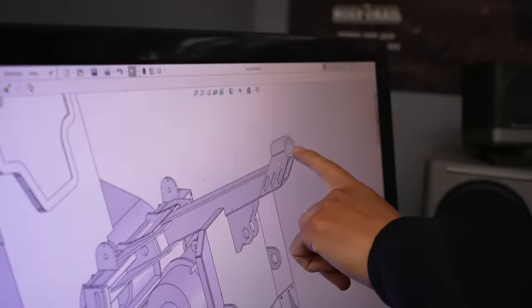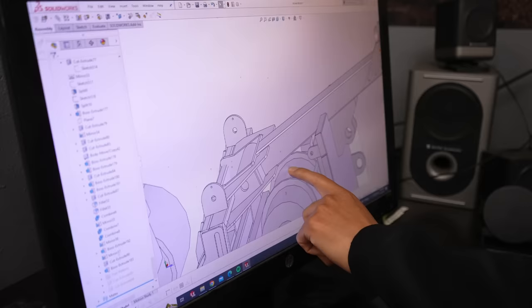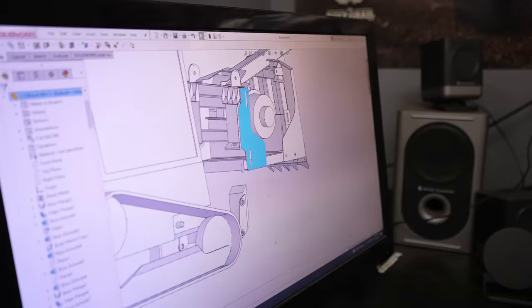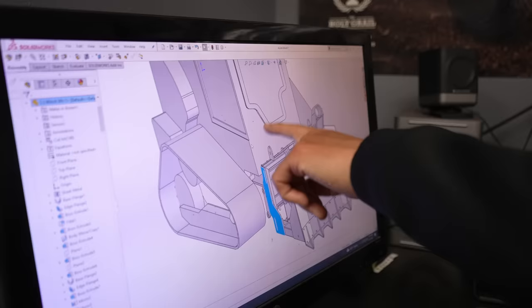The winch goes towards the back. It goes into this roller right here, and then loops around to wrap around the winch right here. It's gonna basically attach to the Minotaur just like another bucket, just a regular attachment. So it'll be pretty universal for that, easy to attach. And then it's a hydraulic winch, so we're gonna use the auxiliary hydraulics from the Minotaur, so you can operate everything within your hand, just up and down and in and out.